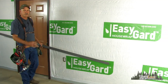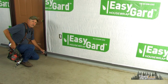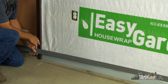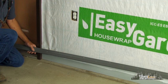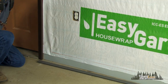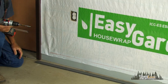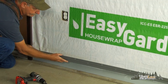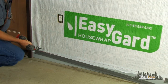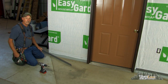We've already installed two pieces of starter from the other end. To finish up, take your last piece of starter, butt it to your last one, and mark. It doesn't have to be exactly tight to the wall — you want to leave room for the J channel. Take your snips, cut the piece at that line, and install it. I like using one inch to inch-and-a-half screws, as long as you get a good bite into your wall. Continue installing the starter around your structure.